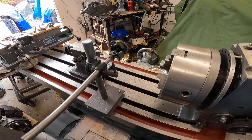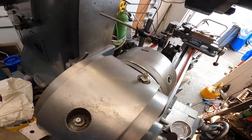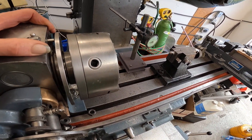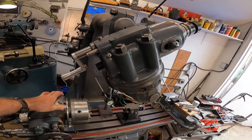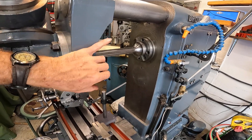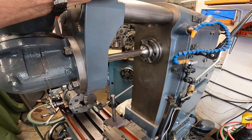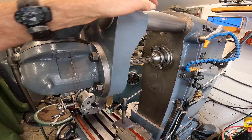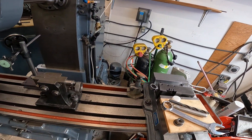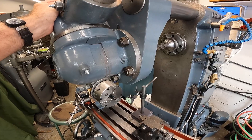That way I'll be able to cut spur gears for the Axelson. I've already gathered up cutters and stuff to do it — not real expensive, just kind of fun. The ability to hook up horizontal arbors makes this a really versatile machine. You can do all kinds of things with it — you can lay the head flat on the table and drill under the side of a vise. You can do absolutely everything on this machine but make money.